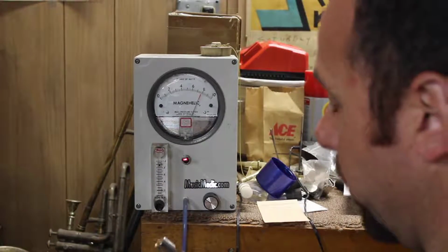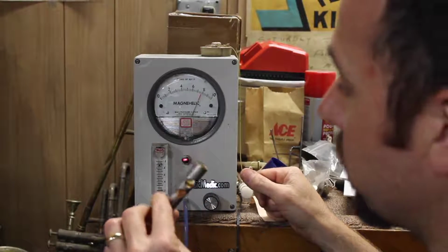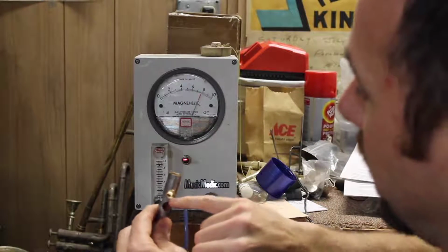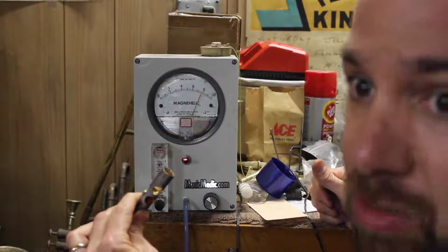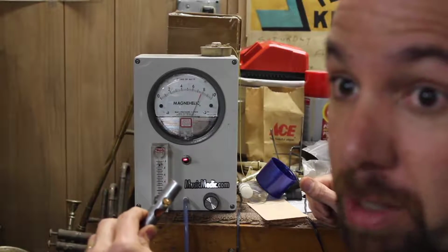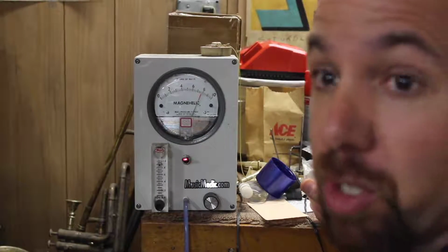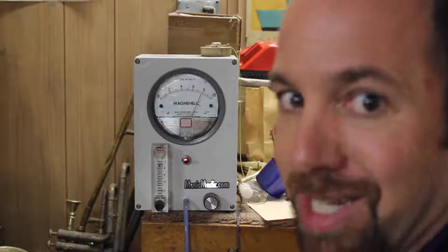It's really hard to see this, but I will include a picture of this crack. It's right in there. Again, the lowest port. I found it after some searching, some help too, and I'm going to take a couple shots and include those with this as well. It's a tiny little crack. I'm going to fill it with some solder, and then test it again, and hopefully the horn will come out in that 0.2 to 0.4 range. That's what it should be for a new instrument. So again, 3.0 is what it's testing at. Let's see what it tests at after I've soldered it.